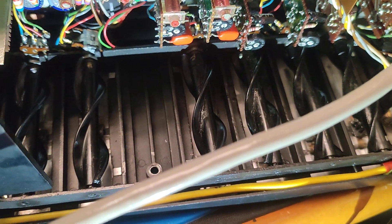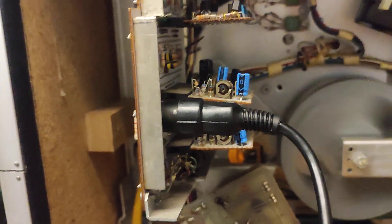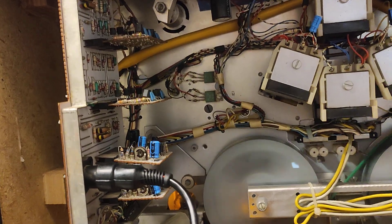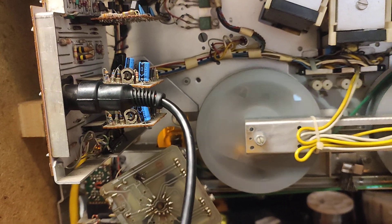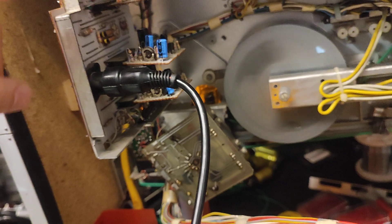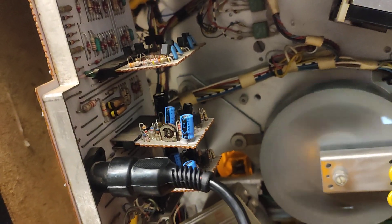So this is the closing part — I'm going to put everything back together now. This is the remote control; I love this thing. Apart from the audio section, the motor control section is famous for reliability. I didn't even need to change the electrolytics, but I changed them anyway, along with the metal transistors known for metal whiskers — just to be safe.